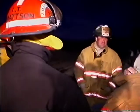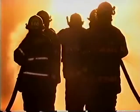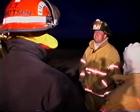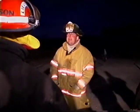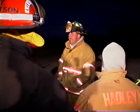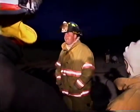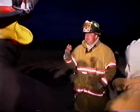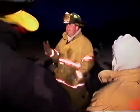All right, if I yell at you, it's not because I'm mad at you, it's because you won't be able to hear me. Okay? This is serious stuff. If you have anything on the nozzle or you're nervous about it, tell somebody now. Okay? You can get burned. Serious, serious stuff. You won't know you're being burned. That's the problem with it. That's how gas reacts. Propane displaces air. So if you're in a confined space where you want to try to attack one of these, I would suggest wearing an air pack. Okay?